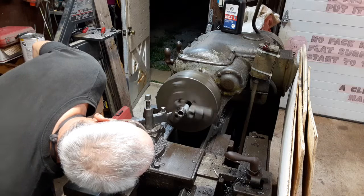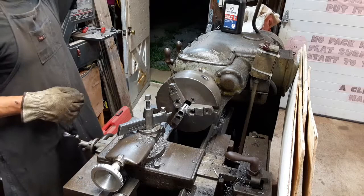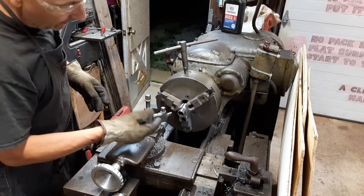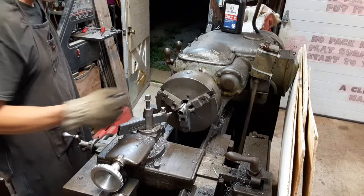Oh, I don't think the part is running out so much. I think it's got different wall thicknesses around it. So, at any rate, I'm going to flip it and clean up the other end. And then I'm going to pause the camera for a little bit while I change out tool bits. And then I'll clean up the surface, and then I'll pause again and go in with the boring bar. Trying to make sure I don't overly tighten this thing and crush this, but we'll see.